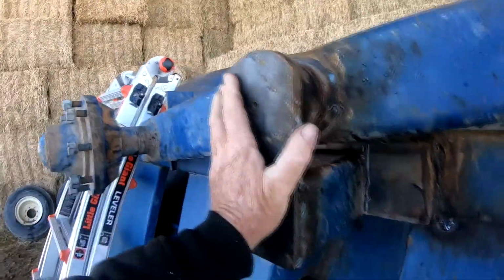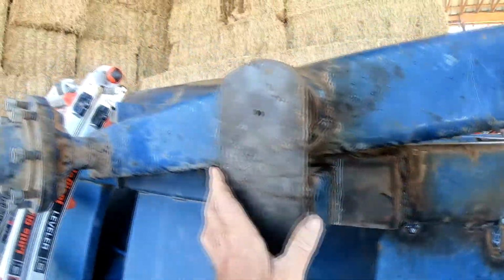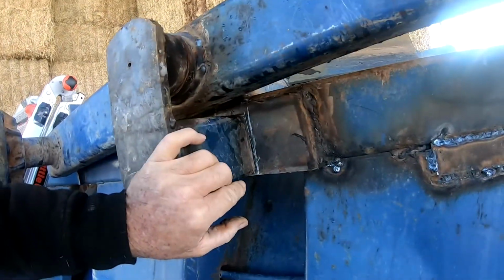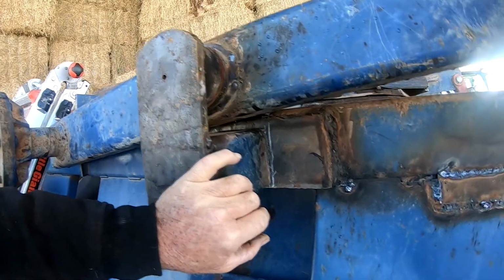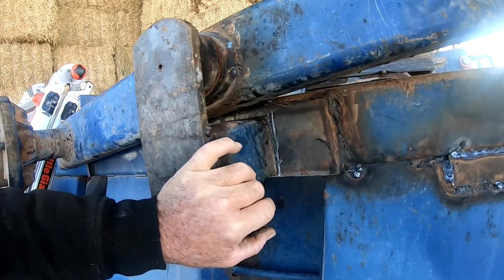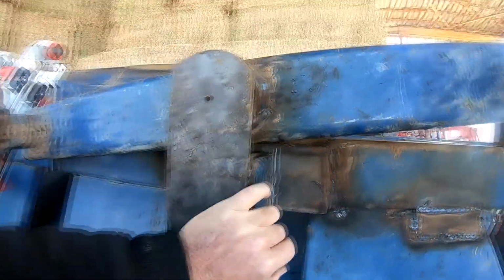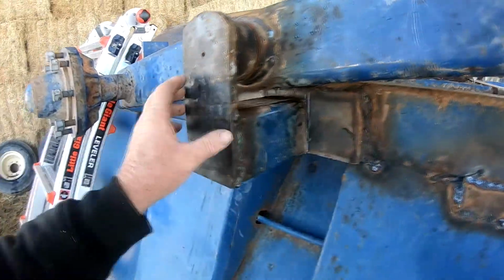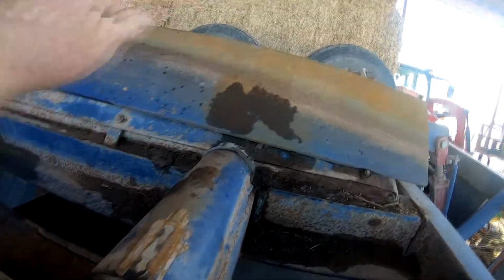As you can see, I have this all fitted with the proper spacing. I'm ready to put it on there and do some vertical welds. I'll probably do a vertical pass with some 6010, burn it in real good, and then go vertical with 7018, and then I'll do this top weld, and as soon as that's done, weld that collar, then we can put the tires back on.